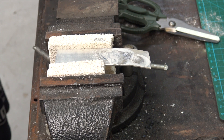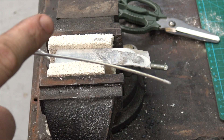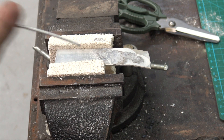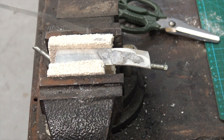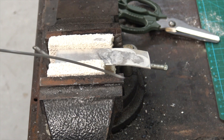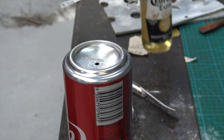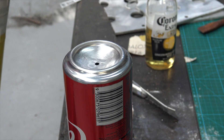I noticed the piece of bar actually started to deteriorate and bend under the heat before the rod did. While I was trying to rub the rod on the piece, the piece might have been hot enough, but the rod was so cold it had to be brought up to temperature first. I know you're not supposed to heat the rod, but that little bit of preheating made it go in and work really well. So maybe I could give that a go on a can — hopefully a Coke can has a slightly thicker bottom.